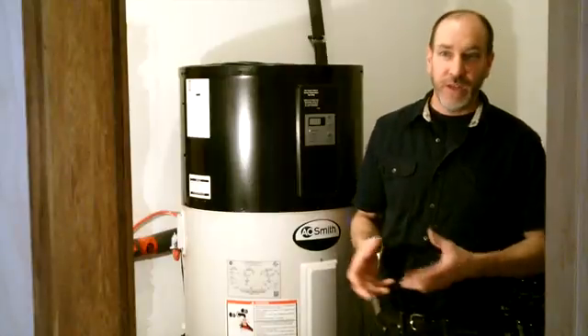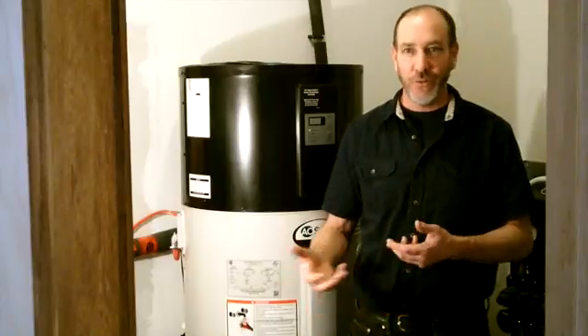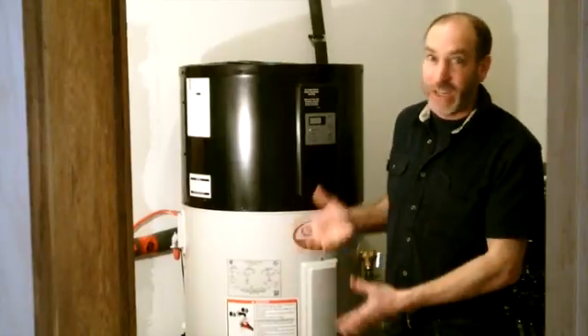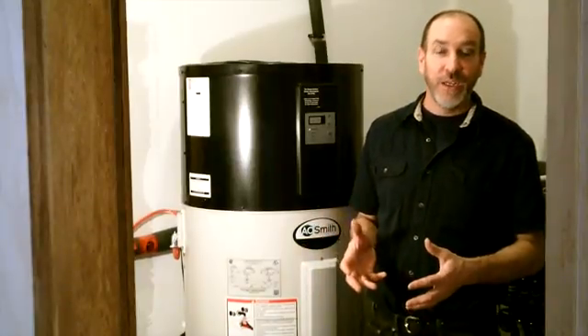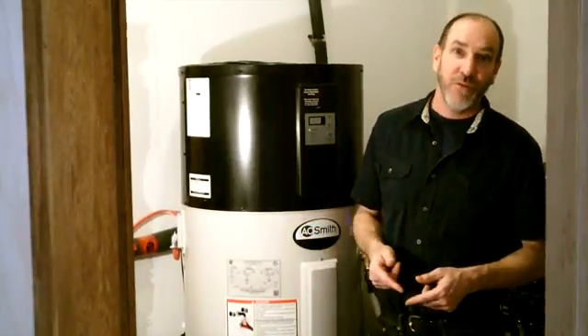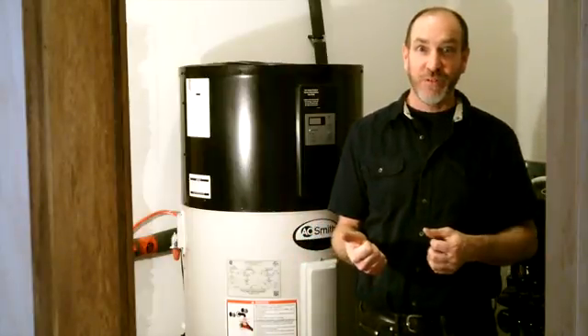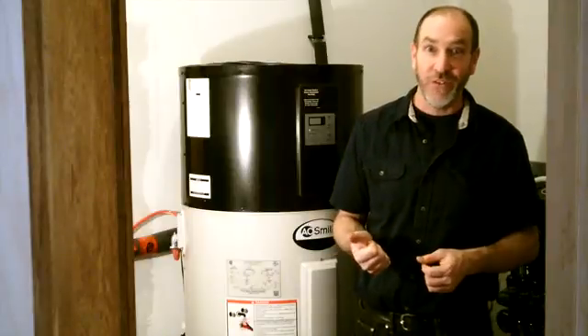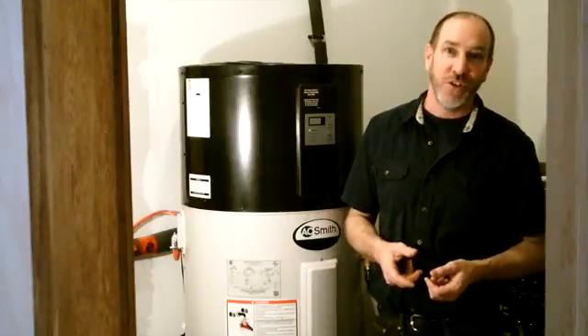To really get the most out of it — it's a hybrid, meaning it has an electric coil. So if there's a lot of demand, like you're washing dishes and people are showering back to back, it's not going to keep up in heat pump mode; that's when it kicks into normal electric resistance mode. You're going to get all the hot water you need, but ideally you want to keep it in heat pump mode, so you need to make sure your tank is sized properly. We also have super low-flow faucets and shower heads, which saves about 60% of the water over most houses. Using less water means a cheaper hot water bill, and those low-flow fixtures increase the odds of this thing staying in heat pump mode where it's most efficient.